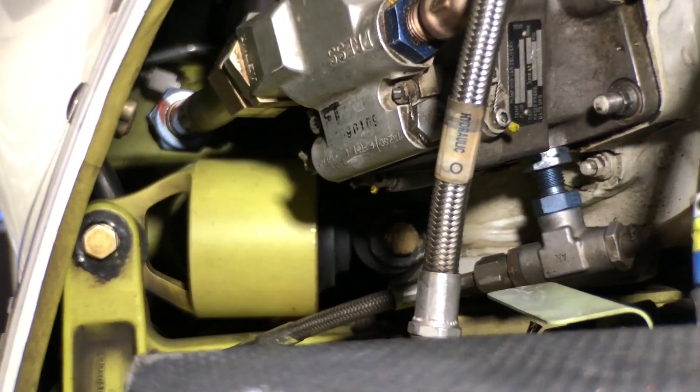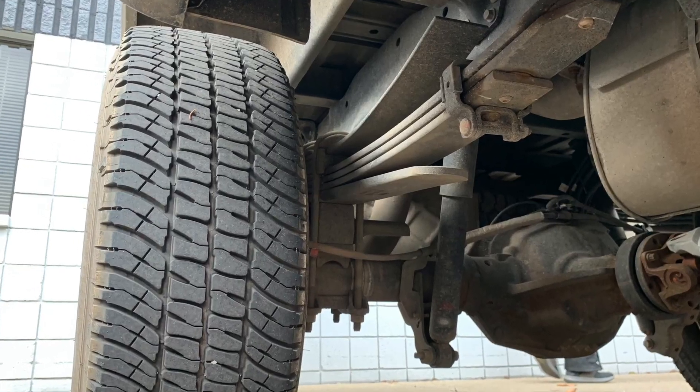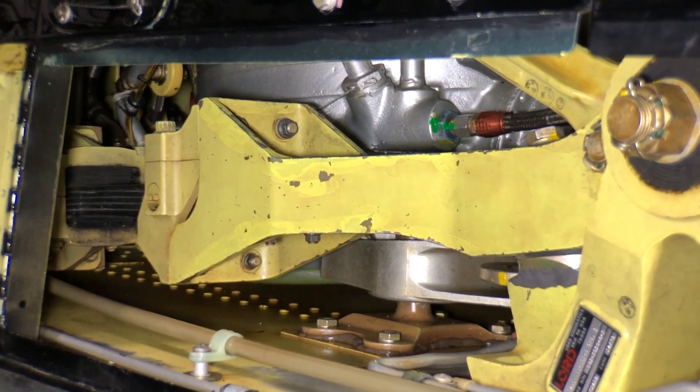All this spinning creates a lot of vibration, and we have several different ways of mounting the transmission to the airframe to eliminate some of it. These methods can include rubber elastomeric mounts or fluid-filled dampers, and leaf springs like you see on pickup trucks. These leaf springs are called nodal beams — these particular ones are actually from a Bell Long Ranger.